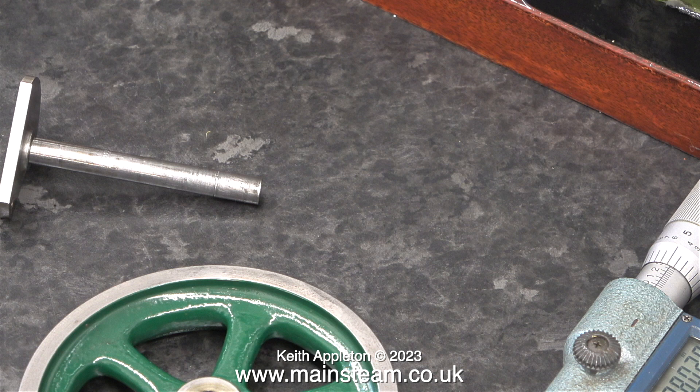As far as I can see, this crankshaft, although it doesn't look absolutely brilliant, is in very good order. Dimensionally it's fine and I will be reusing it — provided of course that it isn't bent. I'll check that in the lathe before I go any further.